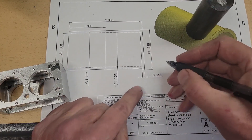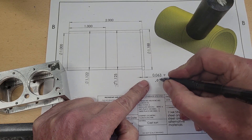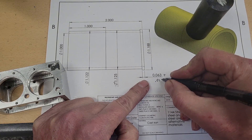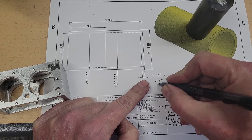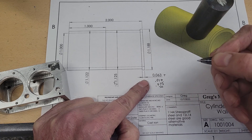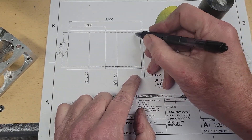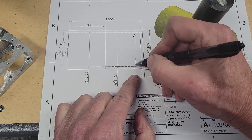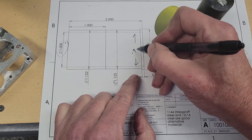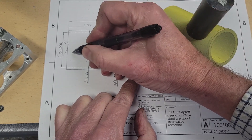The lip at the top of the cylinder is a sixteenth of an inch, but we have ten thousandths of extra material on the top of our block that we want to remove with a fly cut, so let's make this seventy-five thousandths. Our target diameter is one inch, but we know that the diameter at the top is going to be slightly smaller — say 998 — and at the base we'll try to hit our inch.